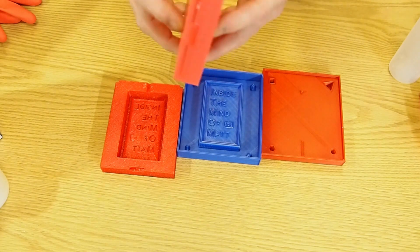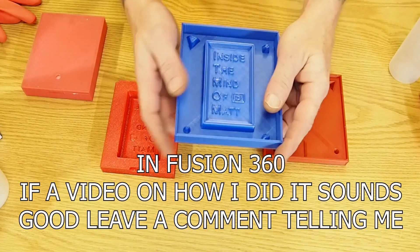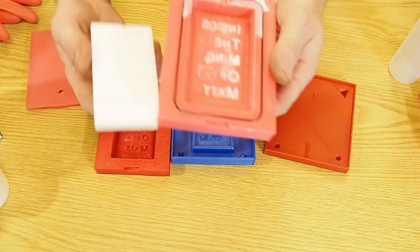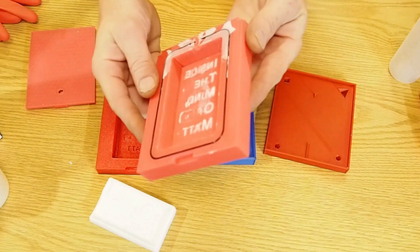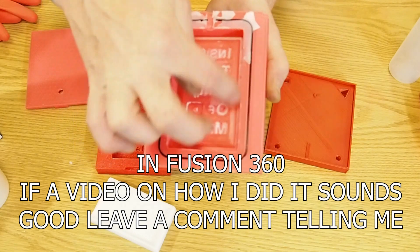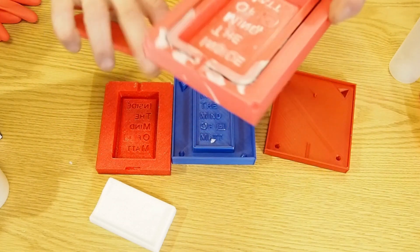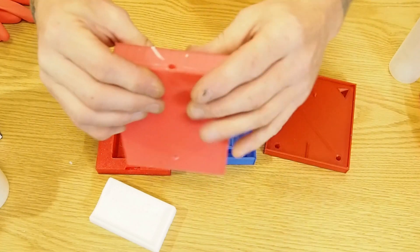I basically took the bullion that I have made, took a box and cut this out of the box, then kind of extruded it into a different form. This was my first experiment and as you see it was a failure, but it's hard PLA. I had the bullion, made a rectangle around it, made it a new body, split this body with that body, removed it and it gave me an empty cavity. Then I put a couple of registers on and corresponding ones on the opposite side. You see here there's kind of like an in-gate and here would be my vent, and they actually snap together quite well.